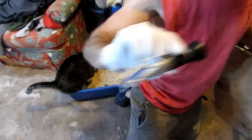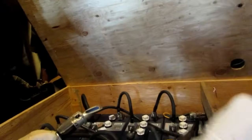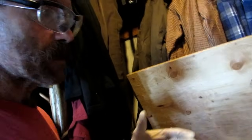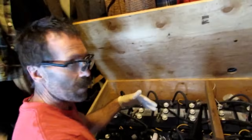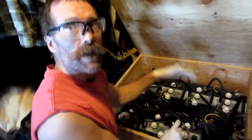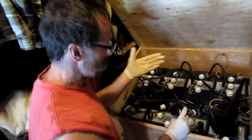The bulb syringe and all that stuff — they're not for solar batteries, let's just put it that way. As I suspected, the batteries are at 100%. This is the specific gravity. Because I've done this enough, I'm not going to check each cell — I'm just going to go and check randomly throughout the battery bank, and if anything alerts my attention I'll figure it out then.